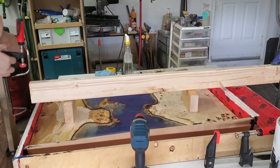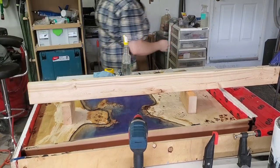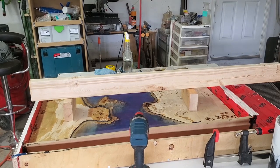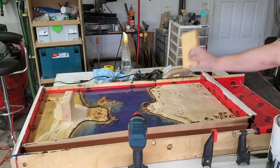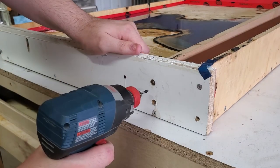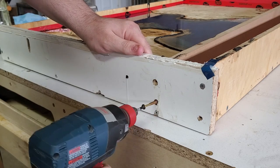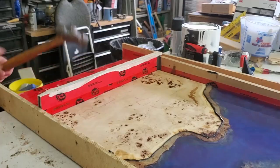Here I'm removing the clamps that hold down the slabs, because if you don't hold them down they're basically just going to float and you're going to have a whole bunch of epoxy sitting right underneath the slabs — that's a lot of money wasted. You can glue them with silicone, but I've had problems where the silicone doesn't cure when it's completely underneath the slab, so it's easier just to throw a two-by-four over and clamp it to the bench.